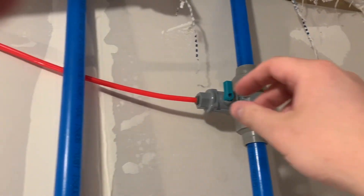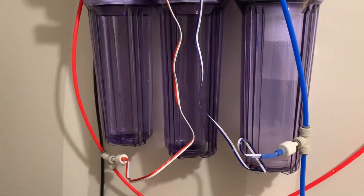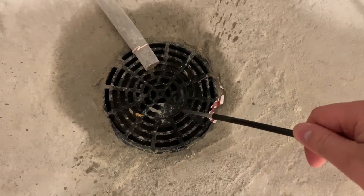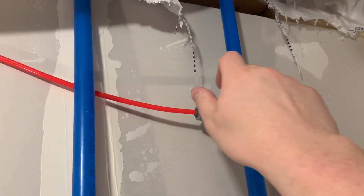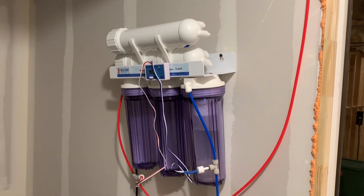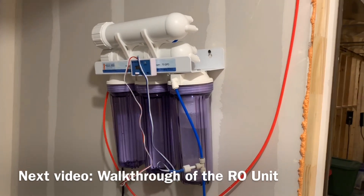This showcases how easy this is to use — one turn of the lever, which is a ball valve, and I have water flowing to the RO unit. This takes up very limited space in my utility room. I'm showing you how this works; I'm bypassing making any RO water right now, but this is one of the many ways you can connect an RO unit. Everything is push connect fitting and you simply cannot mess up a push connect fitting. I was very fortunate to have this PEX pipe set up for a water softener, and even if I did install one it still lets me bypass it. Thanks for joining me — this was a quick video and we'll see you in the next one.